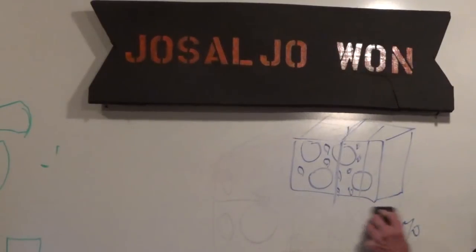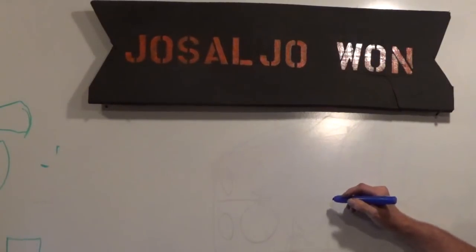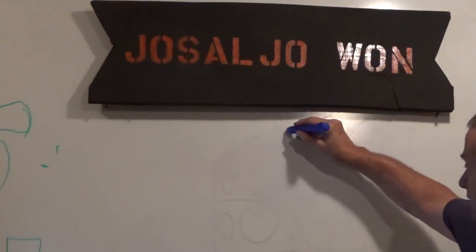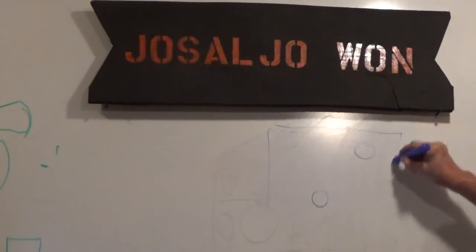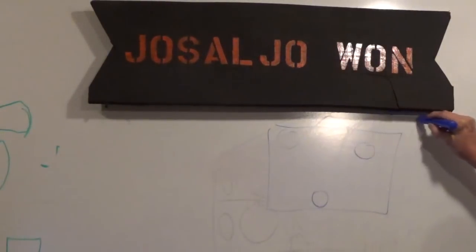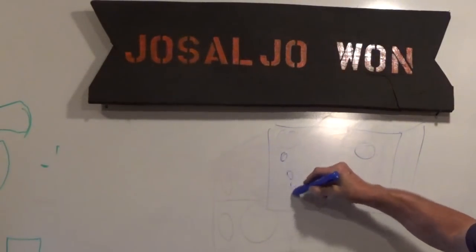So what does this mean? What this means is there's two things that can happen here in reducing relative humidity, especially in your kiln. One is to separate these air molecules. And the way to separate air molecules is to heat them. So hence, in comes the solar kiln. So if we heat the air, we make more space for more water.